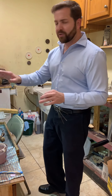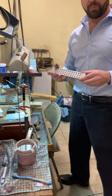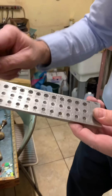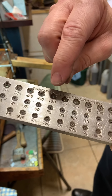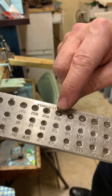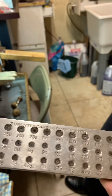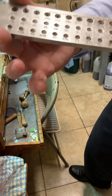So I'm going to soften it up with some heat. After I'm done with that, I get this draw plate — it's called the draw plate — and it has these different size holes. I'm going to pull it from one hole into the next, and slowly but surely it's going to take that square wire and make it round and give it a nice polished finish. It's also going to get hot as I pull it.